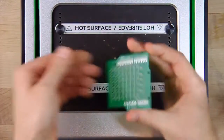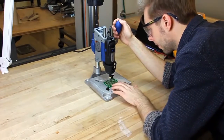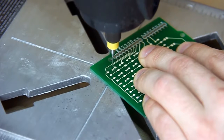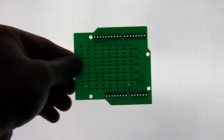Flip the board so it is resting on the ledges of the clamp, then start the bake cycle. Once the bake step is complete, we can drill the holes for our vias. We used an inexpensive PCB drill bit set to make our vias. Alternatively, template boards with pre-made vias will be available if you would prefer not to drill.